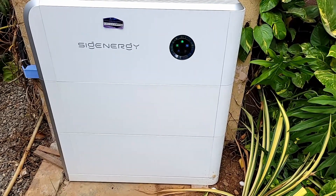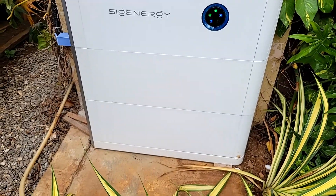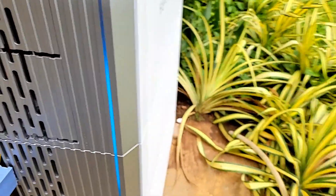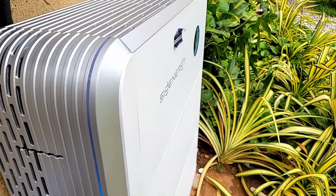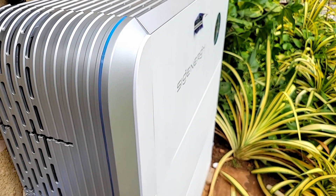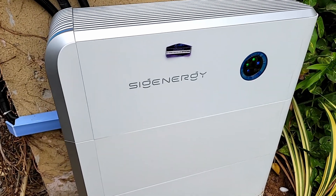As I said, the batteries connect to a bus bar rather than to one another — which is amazing. As for the controller itself, it has three MPPTs, a DC switch, and is IP66 rated, so I could install it outside and the rain can beat it and it will continue to function. It also has cooling fans and massive heat sinks. Since I've installed it, I've basically forgotten about it — it just does what it's supposed to do.